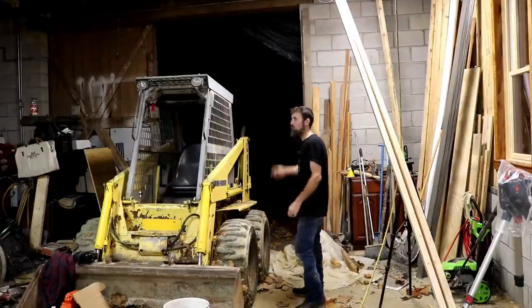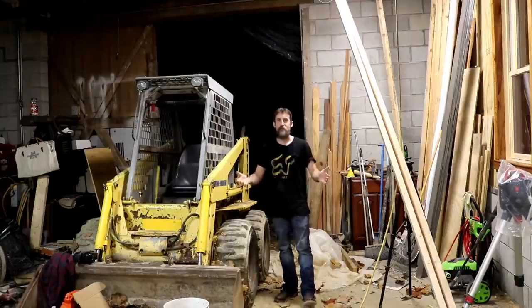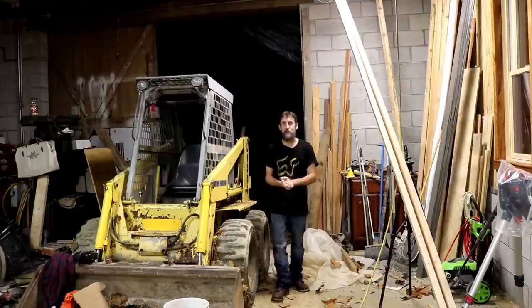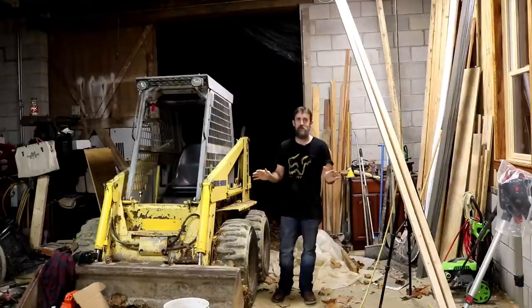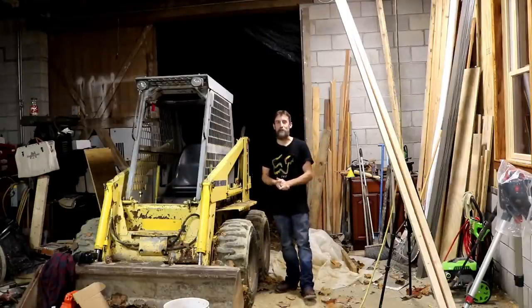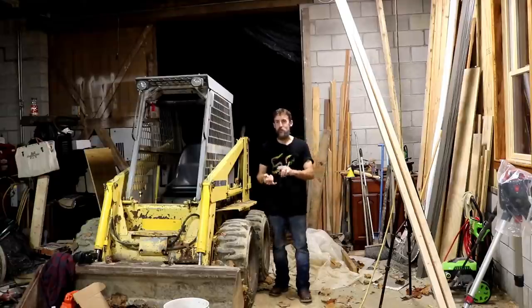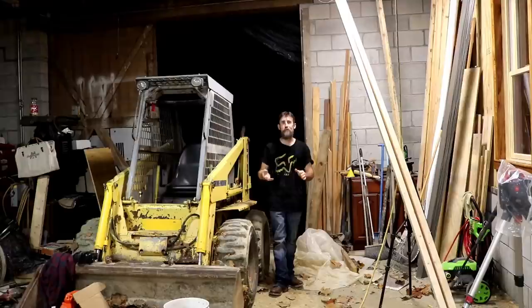So I don't know if you can hear that or not, but it's pouring rain outside, which I wouldn't expect anything less, right? You pull the roof off, it's not a bad idea to invest in a couple massive tarps because you can guarantee that it's gonna rain, no matter what the forecast says, which I'm glad that I was prepared for. One more row of sheeting and this thing will be done, as far as sheeting anyway. Then it's on to the membrane and the shingles, and it's twice as quiet or more in here just with the sheeting on than it was with the tin roof.